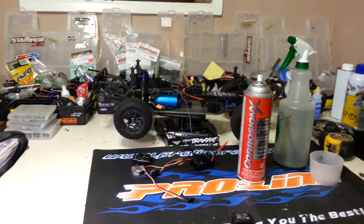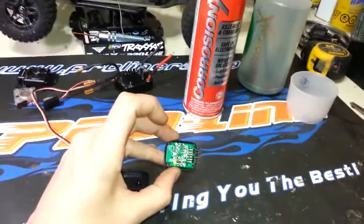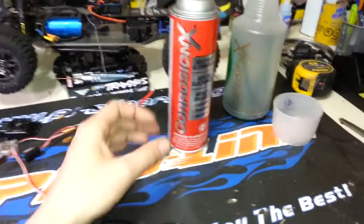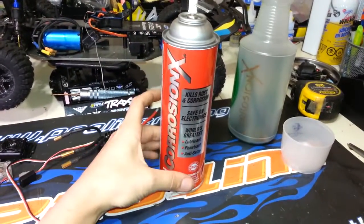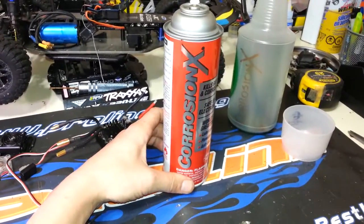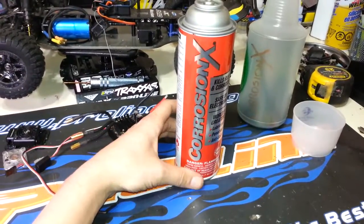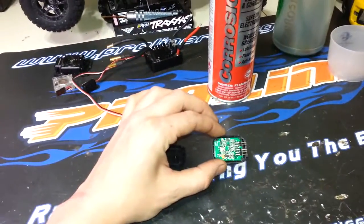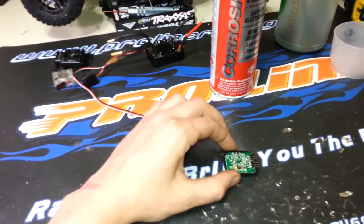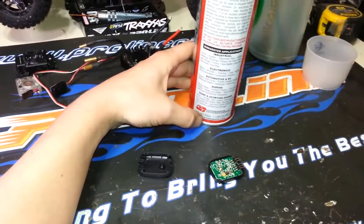Just stop, make the changes, apply, and go driving. So I thought I would show you how to waterproof it. I've taken the screws apart and basically broken this down to the circuit board. This stuff is safe on electronics, so you just spray it right on. You can get this in a couple different forms — one is the aerosol, like this. There's also Corrosion X and Corrosion X HD, which is a little bit thicker. It basically puts a barrier on the board that will not allow water to penetrate. They use it in military applications. It's really like the only thing like it.